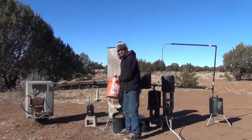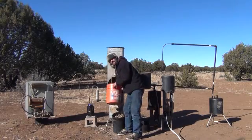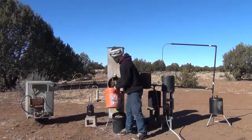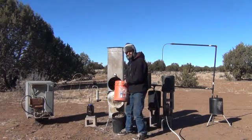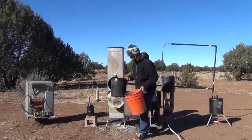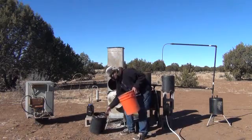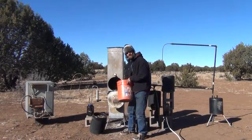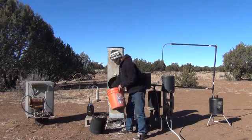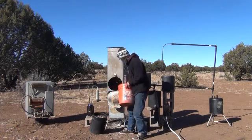We're getting closer and closer here to getting this full. This is a necessary part of this stove. The production models actually have a 20 or 30 gallon or even a 50 gallon reactor can like this that comes with it, because this doesn't produce more than about 35-40 minutes of usable gas, and that's 5 gallons. Now you can imagine what you can get out of a 50 gallon can. It's a much bigger stove than this and made out of higher grade metals. This is just a prototype to show you how to do it.